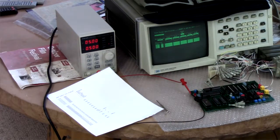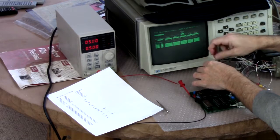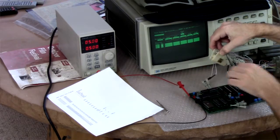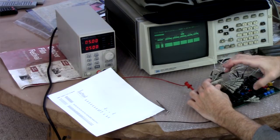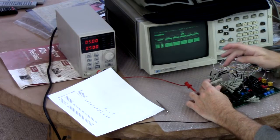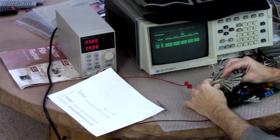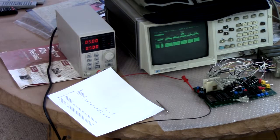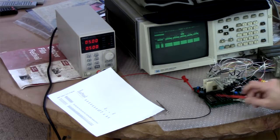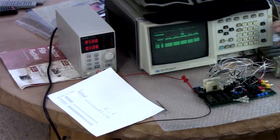And those are done. And now we'll put the clip onto the processor. Try to do this neatly. This is the clock. All the rest are address lines. And it appears to be on. Okay. So, anything else to do here? We've got ROM, RAM, decoder chip, CPU. That should work. So we'll tell that to run.